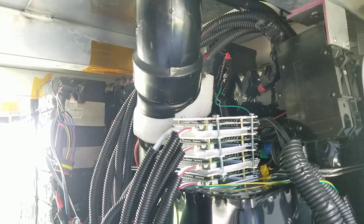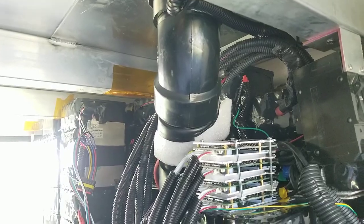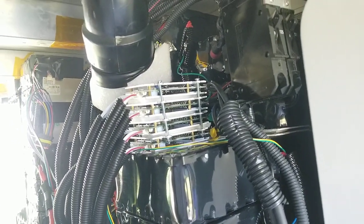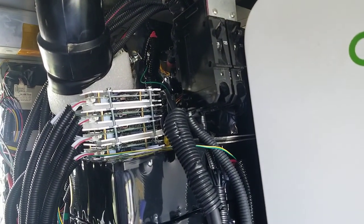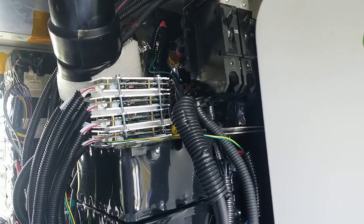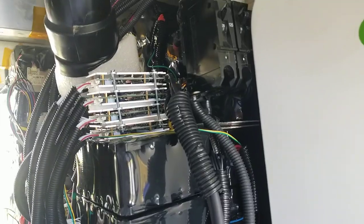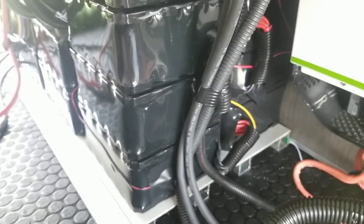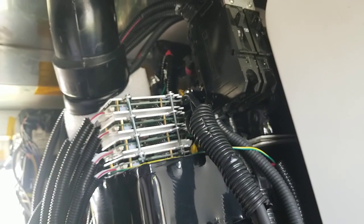With this battery design, this could be reconfigured at a later date to be a 24 or a 12 volt pack, and I think that gives these cells a maximum life and maximum reusability. You should be expecting not just the standard 10 year life, but with all of these additional safety constraints, you should be expecting probably 15 to 20 years, based on what every manufacturer is warranting these batteries for, because these are the batteries that have the exceptionally long warranties. For lithium iron phosphate batteries, you typically see 10 years.